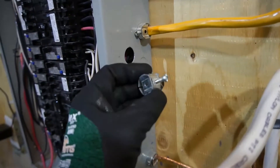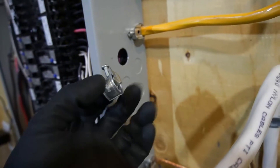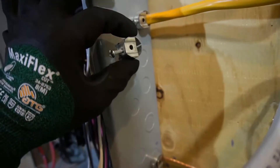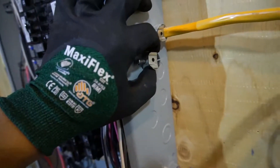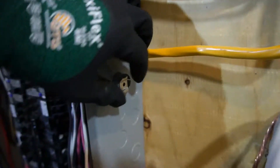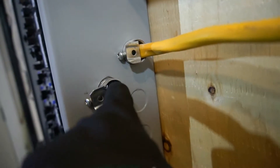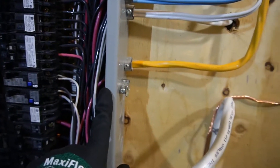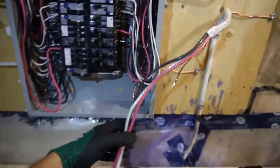To put one in, make sure the screw is unscrewed all the way out. Then you want to squeeze the Romex connector down so it fits in the hole — it shouldn't take too much effort. And that's how it looks. Now you can slide the plate up where the wire can poke through. Before poking the wires through the cable connector, you must have enough wire that will be able to reach your breaker and the ground bar.